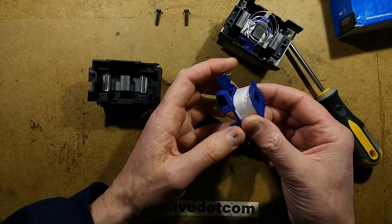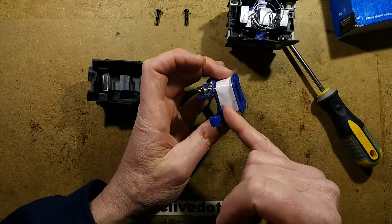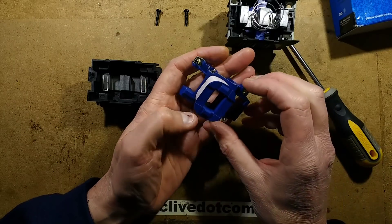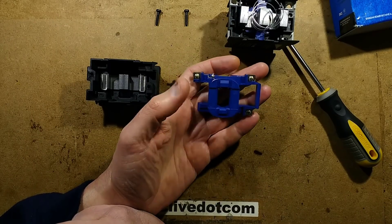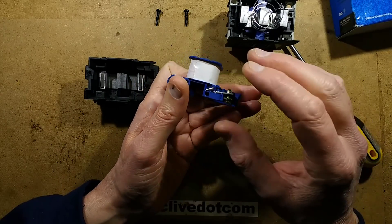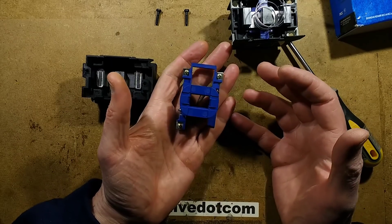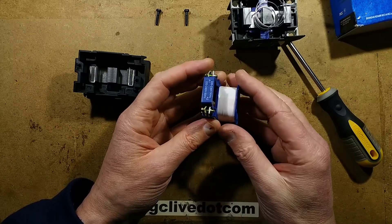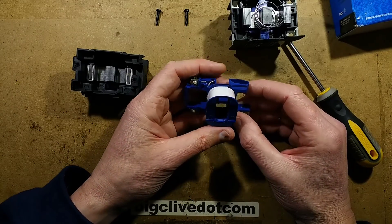The main variation between coils is that a lower-voltage one — say 12 volts — will have roughly the same amount of copper but fewer turns of much thicker wire. If you had a really specialist voltage, you could theoretically strip this off and wind one yourself, or rewind it if the core wasn't damaged. But that's not recommended in an industrial application — I'd only consider it if you absolutely could not get an identical replacement for a specific application.